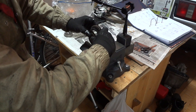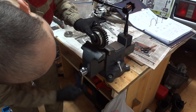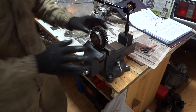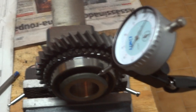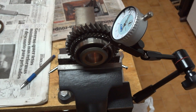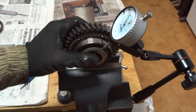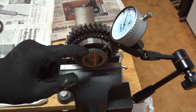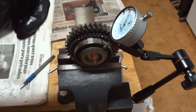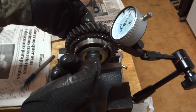Place the gear through the side very softly on the vise, just to hold it. I'm now measuring the oil clearance for the gears, between the gears and the race. You have to do this with the bearing installed. You use your dial indicator over the race and see how much it moves when you try to move the race up and down.